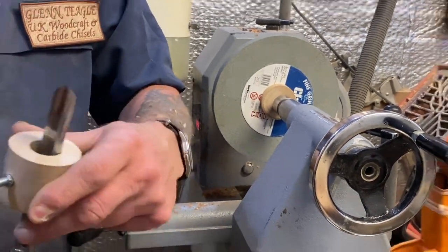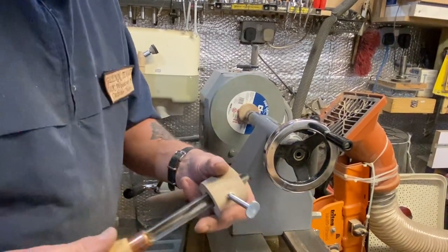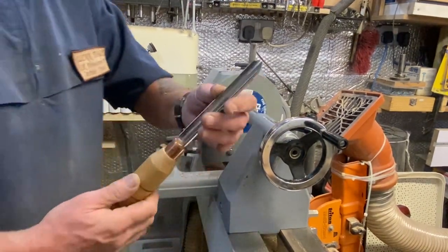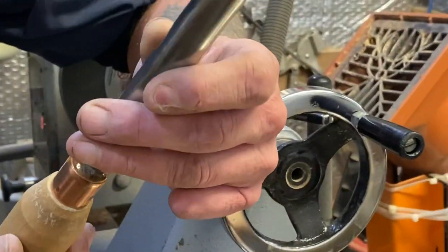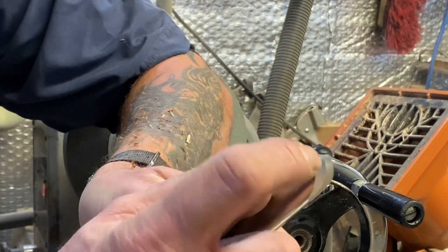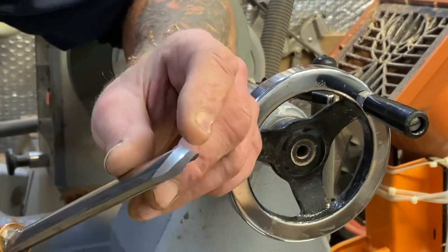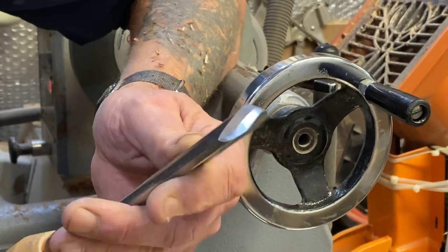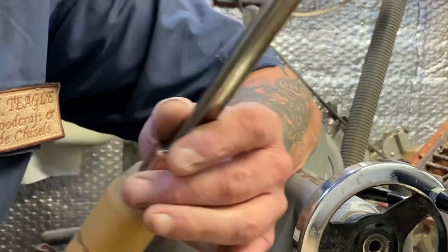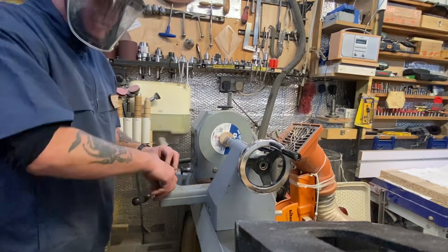Right, so we're going to take that out of there. There we go. Pop that out, and I'll just pop that down there, and I'll show you guys. Now I'm hoping you can see that. I've got a single facet all the way around, okay, and I've just put a second bevel on. That means when I come in, I can just roll it a bit better. I like a second bevel on mine. I explained that in one of my other videos, but I'm going to do a few cuts on a piece of wood in a minute. Do we just see how sharp that is? Okay. So remember, that's this chisel here. I'm going to put it down on here. Right. So that's for doing that.